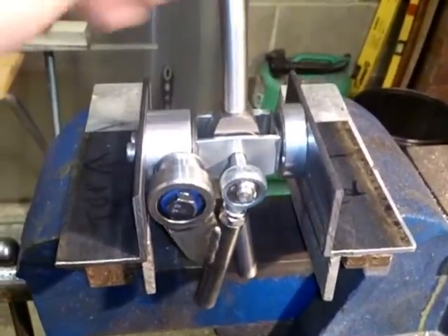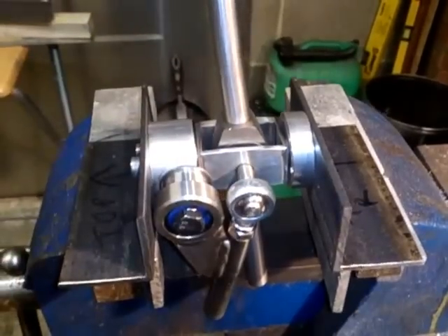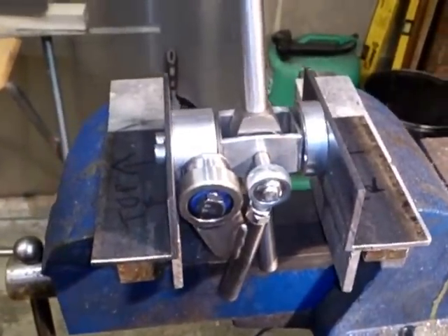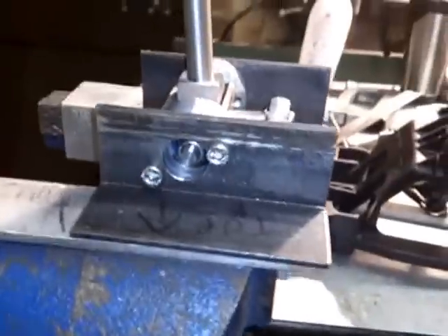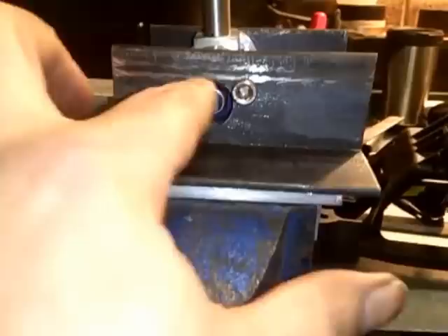So I've put it all together. This is a dry fit so it's pretty much as it would be in the car, except there's a spring missing here — I've not put that in because it makes life a little more difficult. In the last hour or so I've been building these brackets, so two brackets, one in the front and one behind — this is the front incidentally — and as you can see they basically bolt directly to the front and rear bearing bushes. I've left enough room here so you can get a socket round there and undo the nut if you need to.